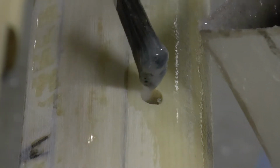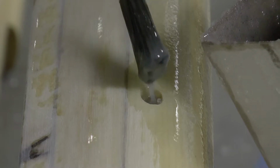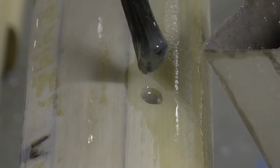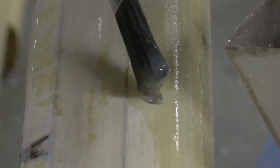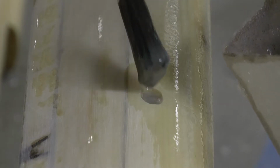This is to make the holes watertight. So I have a wider hole filled with epoxy that I make a smaller hole into. Thereby the hole will be completely surrounded with epoxy.